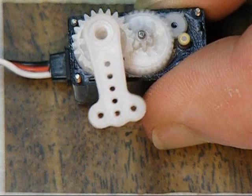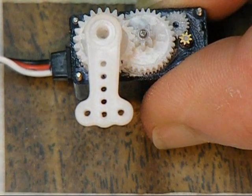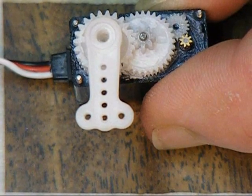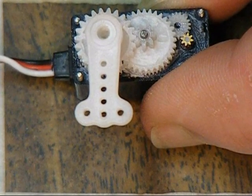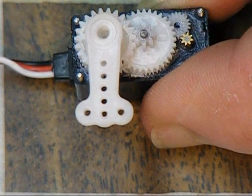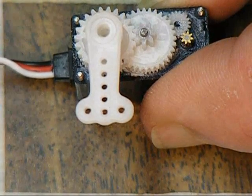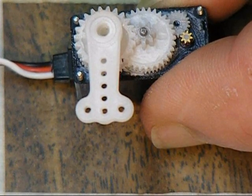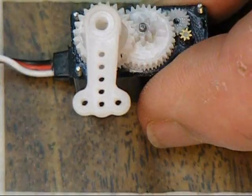It didn't move at all. Now I'm operating the rudder control left and right — and there's center. I hope that makes some sense. I've kind of rambled around but maybe that'll help clarify how you set this up. It's the fact that that brass shaft is your feedback loop and it's infinitely settable. Thanks a lot for watching.